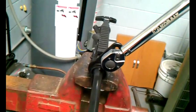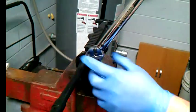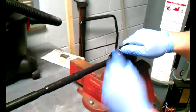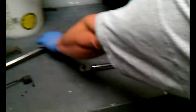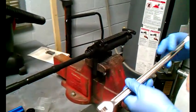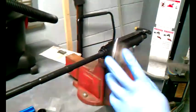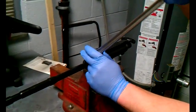What you'll do is pull down. Now you're set at 30 right here, and you'll take that off. You'll get either a breaker bar or another socket wrench — but you never remove whatever you torqued with the torque wrench. Use another wrench. At 30 foot pounds you lock this in place and then take it off.